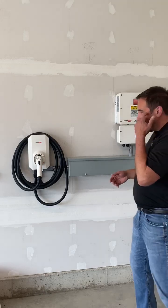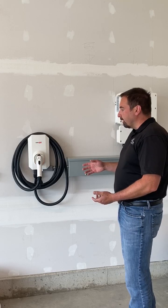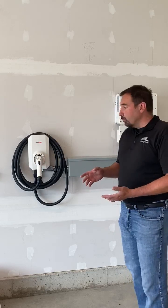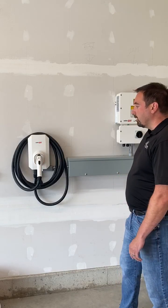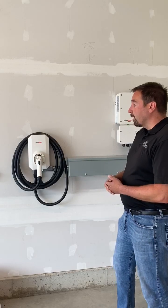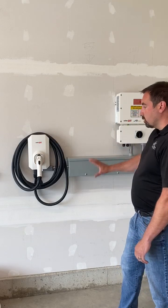The alternative with a standard EV charger is that it has its own connection to a breaker and to a service panel, and very often there's a limitation there. There might not be enough spaces in the breaker panel — it might be full — whereas this system utilizes just one connection for both.